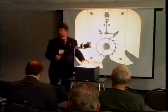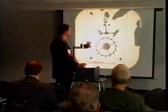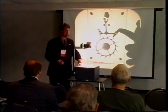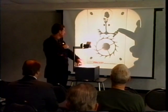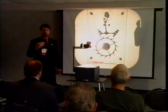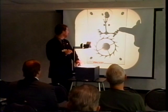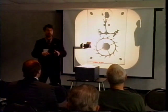So we have to have equal total lock, equal fork horn clearance, equal guard pin clearance, but the total lock has to be not only equal, but safe. So the next thing we want to do is put power on the watch. And when we go to check our banking pin or our fork horn clearance, say the watch receives a jar, do we lose our lock? Do we still have lock? Then with the power on the watch, draw causes the pallet fork to come right back up against the banking pin, and that should be on both sides. You want to have safe lock, so we want to make sure we have equal fork horn clearance, equal guard pin clearance, equal total lock, and then safe lock. So those are the four main things we're looking for.